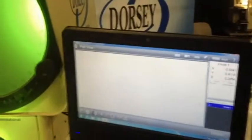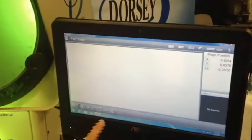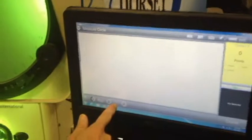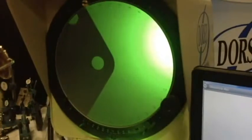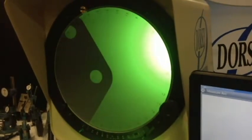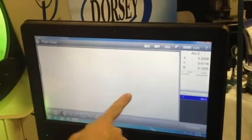Let's say I didn't want a circle — I wanted a radius. I'm going to delete that off there because that's not the way I wanted it. I wanted a radius. So now I'll come back down to the symbol, and if you look, you'll see a circle and you'll see a radius. If I want a radius, I'm just going to touch the radius. It says measure. So now I can come back up to the tangent point again and start measuring points. Get close to the tangent but don't get into it. Come back to the screen and say done. There we have a radius now.